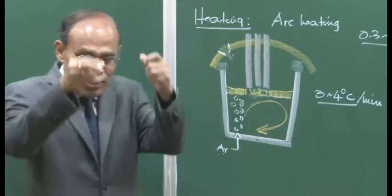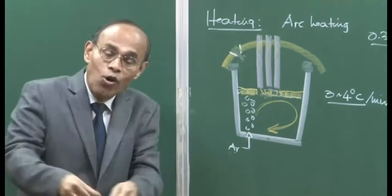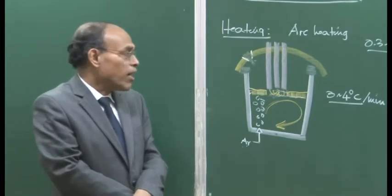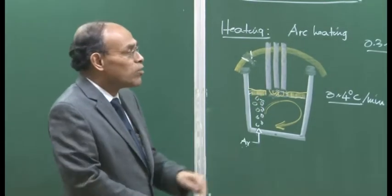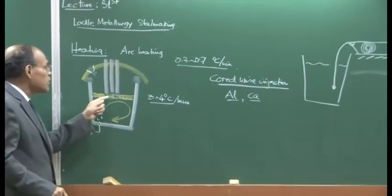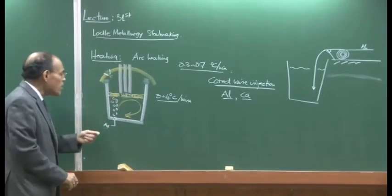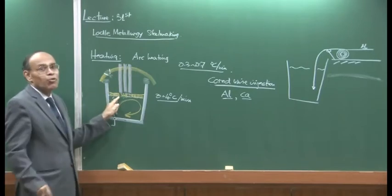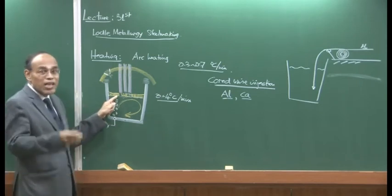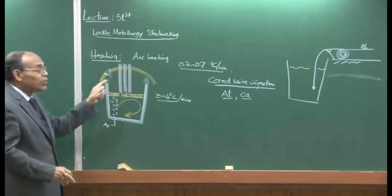And also, because of the tapping stream, in the vicinity of the stream you have enormous downward flow, which tends to take lighter aluminium, dip it inside the melt and dissolve it without letting it get exposed to the environment itself. So, beyond the ladle, in the LRF, it is perhaps not desirable. You can add elements like lead, you can add elements like ferrochrome, etcetera, but perhaps adding pure aluminium, which has a very small density relative to steel, is not desirable because it will like to float on the free surface, be eaten up by the slag if it contains FeO, or react with the atmospheric oxygen.